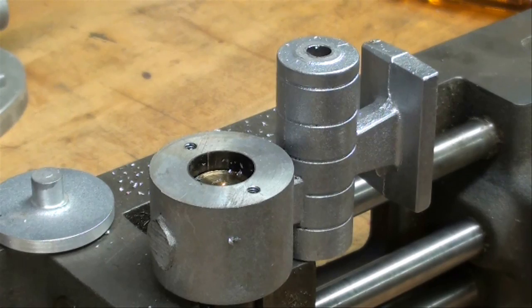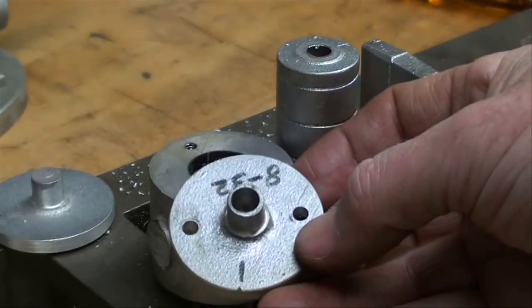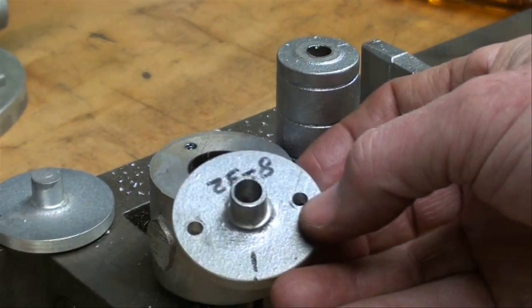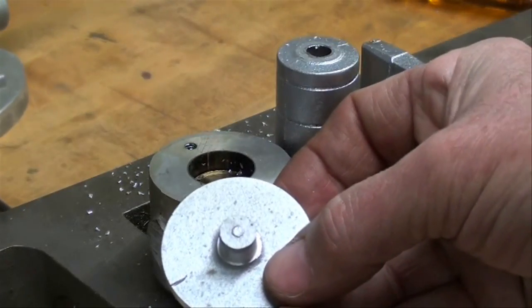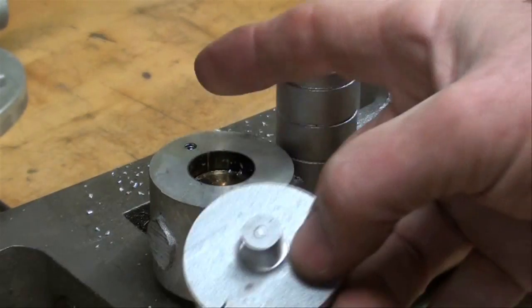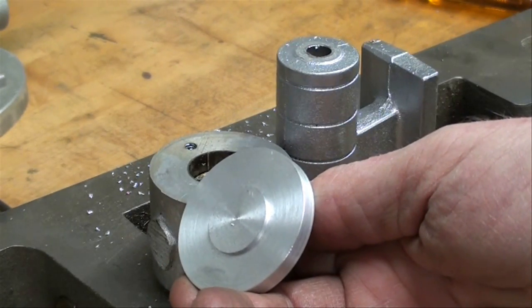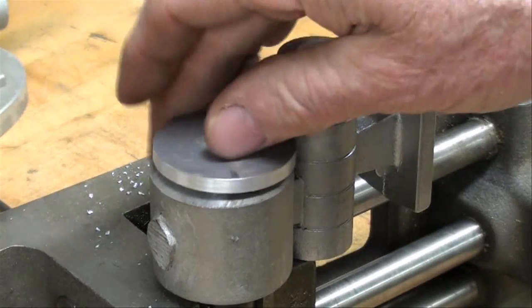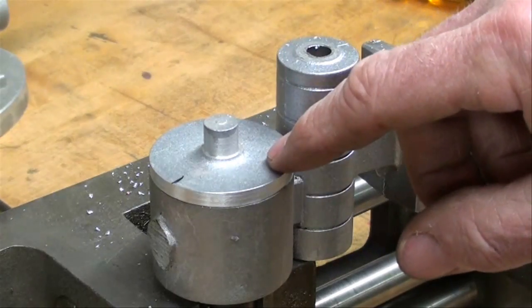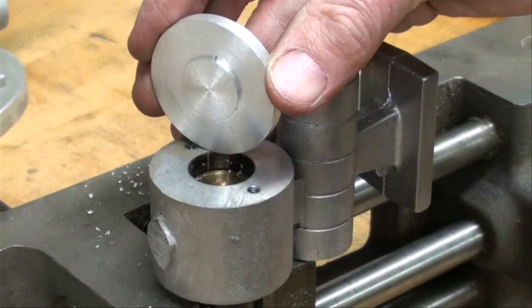Now this is the second part of the video. Let's say for example that we lost this piece or ruined it, and now we're stuck with a casting with two holes and a raw casting that we want to align up with those two holes. This one has been machined on the back with the step and faced off. We're going to put transfer screws in there, lay this on, and tap it with a brass hammer, and that will give us two center-punched holes.